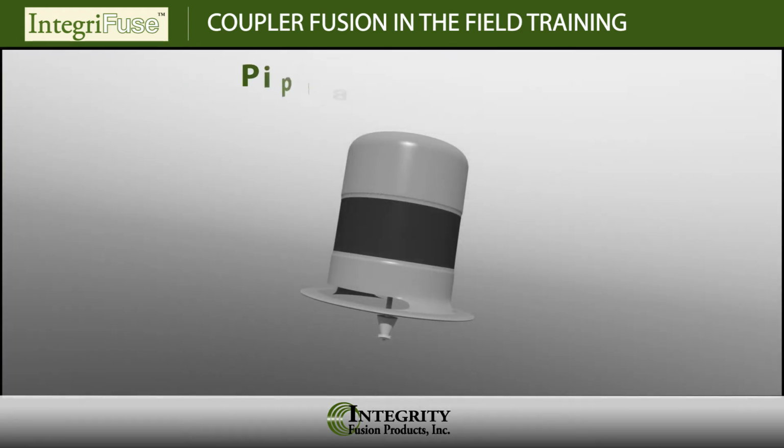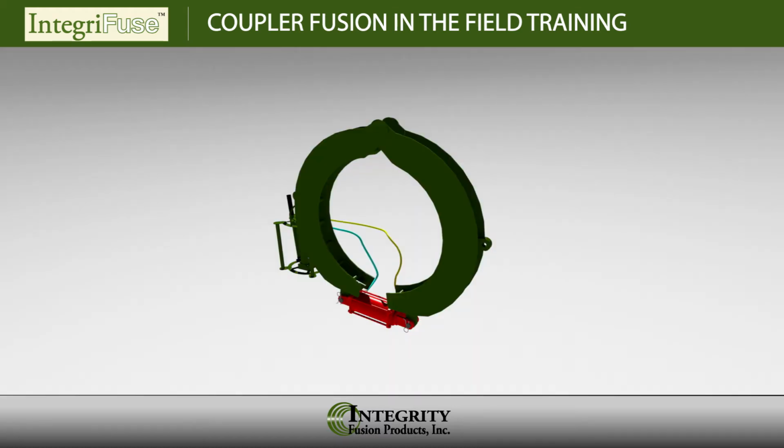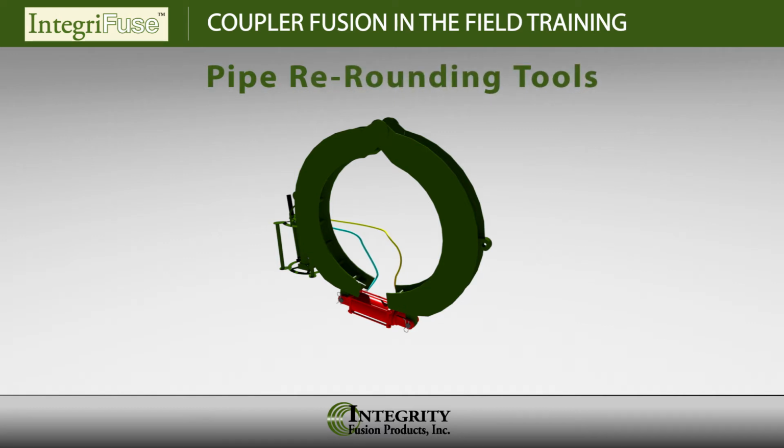Pipe beveling tools to be used for both deburring and beveling the pipe ends to help facilitate easier initial installation of the fitting on the pipe and to prevent inadvertent damage to the wires in the coupler's fusion zone during installation. A router with a 22.5-degree angle bit or a power planer has been found to work sufficiently. Pipe rerounding tools are typically required on larger pipe diameters to aid in sliding the coupler onto the pipe as well as minimize the possibility of experiencing excessive gaps during the fusion process. Care must be taken to ensure that the polyethylene pipe is not out of round before attempting the electrofusion process.